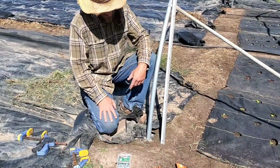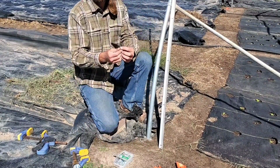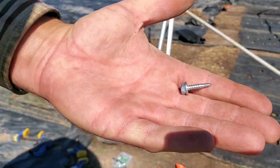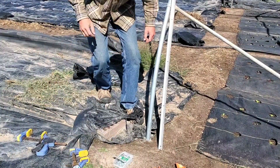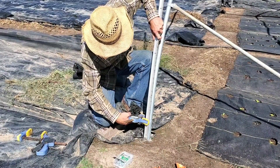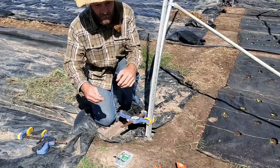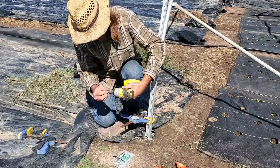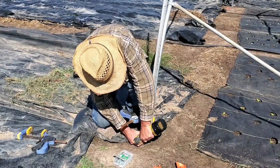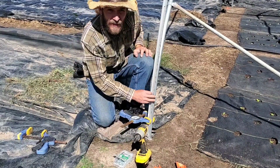Now to attach my channel to my bows, just use 3/4 inch Tek screws. Pretty simple. Use a clamp. This way I have an extra hand. Clamp it in place, which holds it in place for me. I got my pre-drilled track. I drive a screw. There we go. Now I just continue on each hole all the way around.